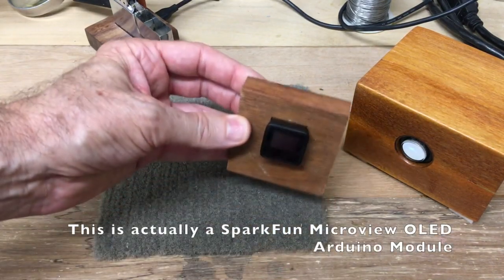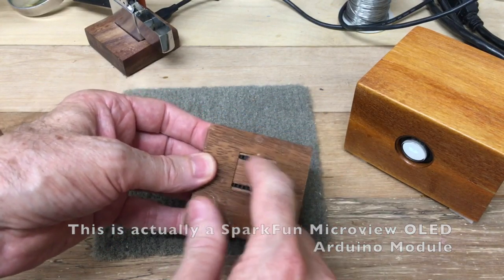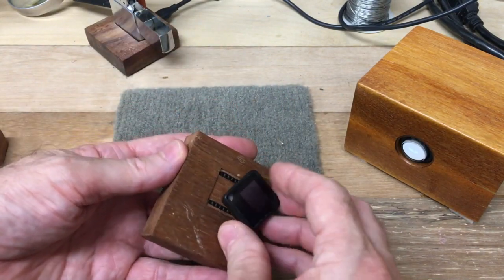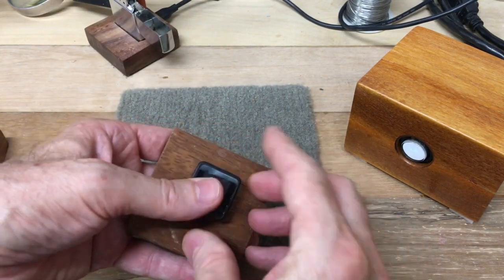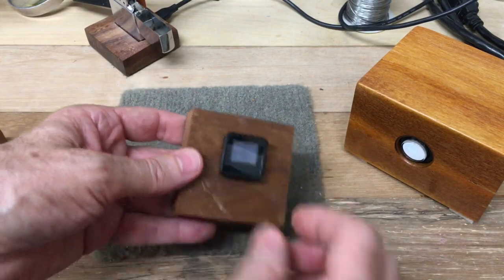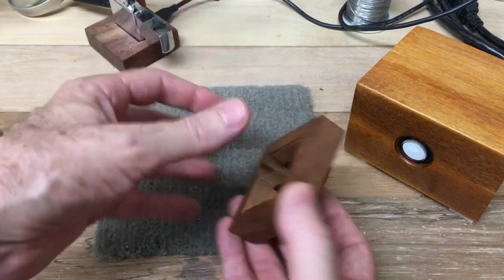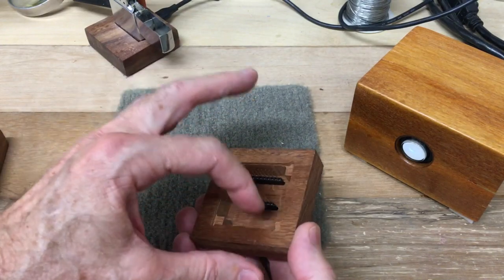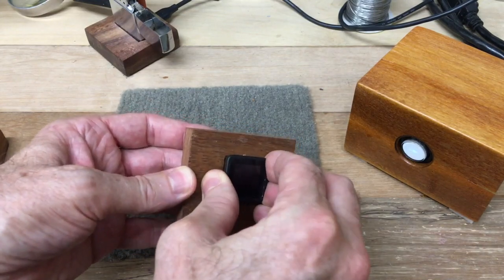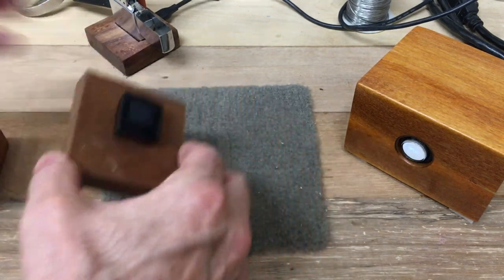Here's one that I have with a display mounted on the top. I've put in two connectors so I can plug my display unit in — a little OLED display — into the top. This actually has an Arduino processor on it, so you can run a project around that connected to these pins, or set another Arduino or Teensy in there to power the display and pass images or text back and forth.